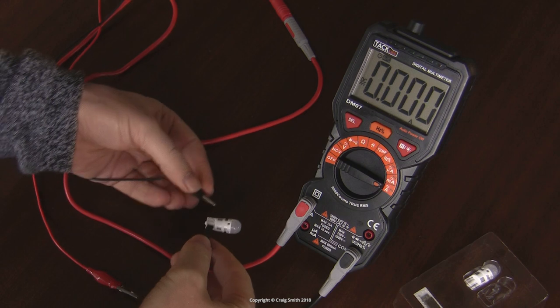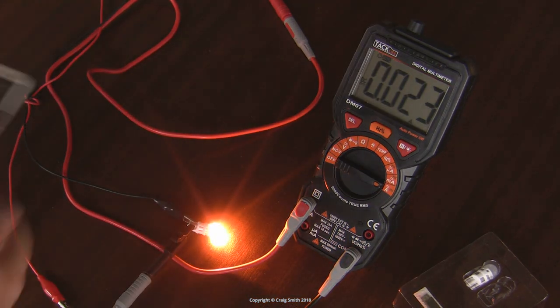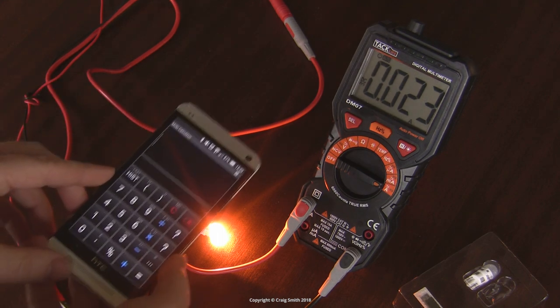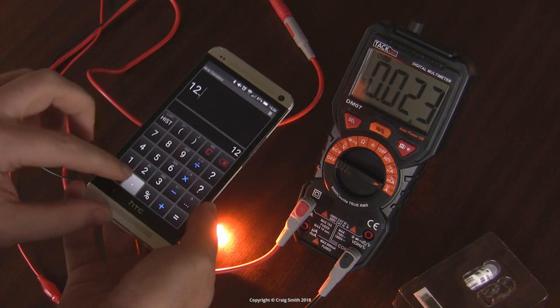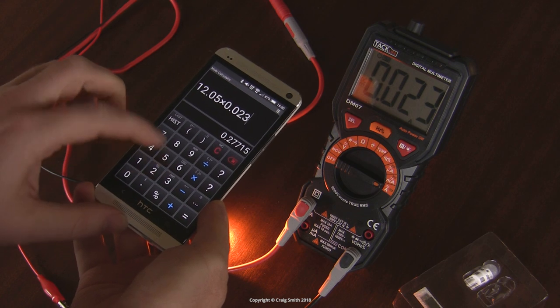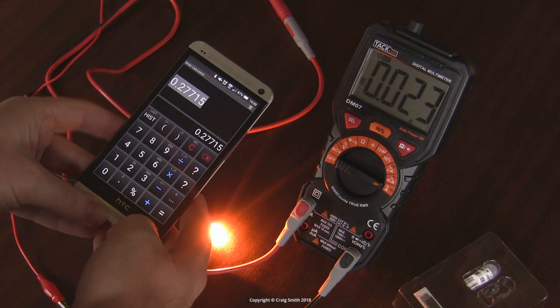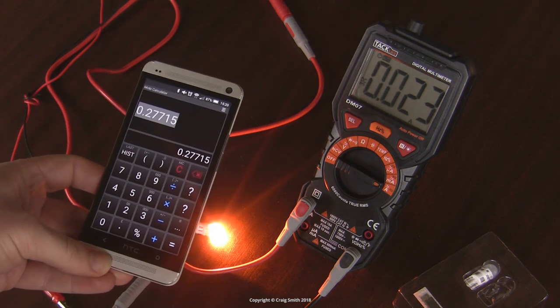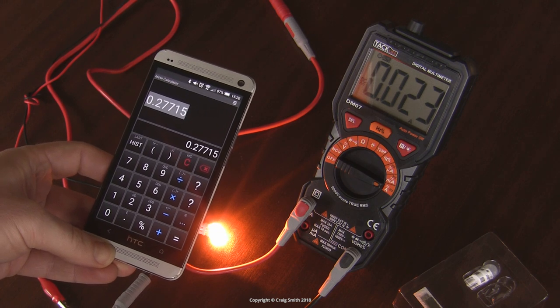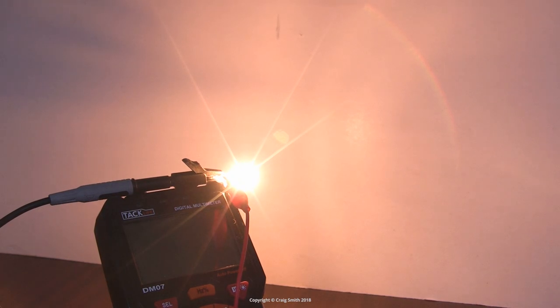Let's light it up and see how powerful it is. Here you can see it's drawing 23 milliamps, which is not very much at all — that works out to 0.28 watts. Their more powerful white LEDs tested closer to a full watt, so this is not overly powerful. However, bear in mind that unlike a white LED, an amber LED only has to reproduce the color we actually want — amber — and the full-spectrum white light from the original incandescent 5-watt bulb is mostly filtered out and wasted in use.